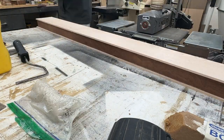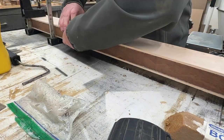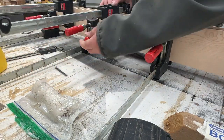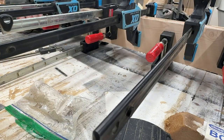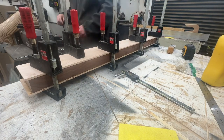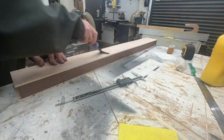To make the sandwich for the white edges on the sapele center, I get three of those strips — one cut in half — and that makes the two sides and the two end pieces. In hindsight, I just used the clamps on the board directly. If I did this again I would use some kind of cauls or a wider piece of wood to apply more clamping pressure across the whole surface, because I did have one edge that wasn't quite perfect. As always, the learning continues.